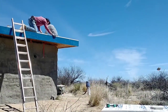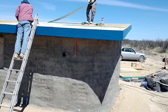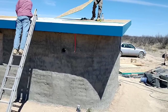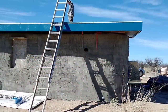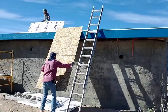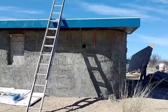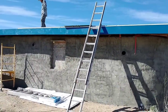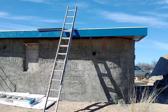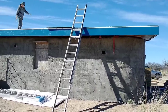This one-inch board will still provide a crucial function — it will create a thermal barrier between the purlins and roof beams and the rest of the roof layers, preventing thermal bridging. We are attaching the foam board in a few places with roofing nails with wide washer heads to hold it down and keep the wind from blowing it off until we get the next layer on. We are putting a few pieces of foam down in a staggered pattern before adding our first piece of sheeting. The screws used to hold down the OSB will go through the foam and into the purlins for a secure connection. We did consider a much thicker foam layer as we did on our house, but that adds significant cost in both foam and an extra layer of purlins. We felt a relatively thin foam layer would be sufficient while still providing a thermal break to prevent thermal bridging.